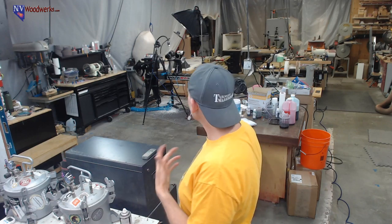So I've had some good luck and a couple of bad times with this Carter sphere jig. And I think that the reason that I had problems was because I didn't have it set up properly. So far, I've been getting really good results. Everything's set up properly. The big test is going to be, I want to get something larger on there. That's where I ran into problems in the past. It was on larger spheres. But again, I'm pretty sure that I had the cutter way too high, so I'm not surprised that it was digging in.